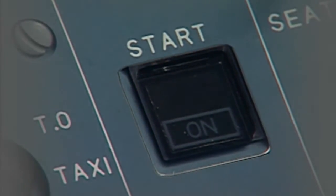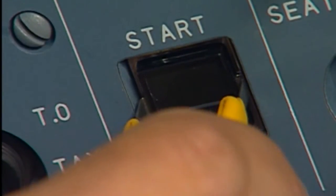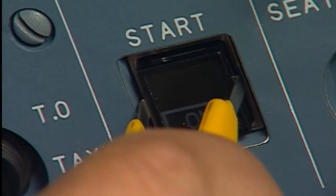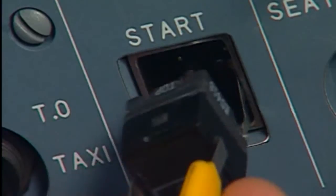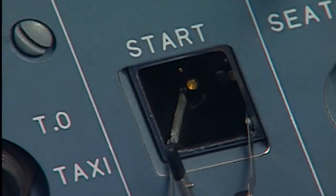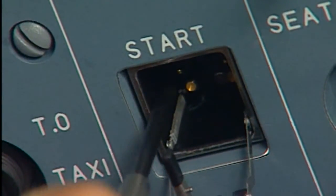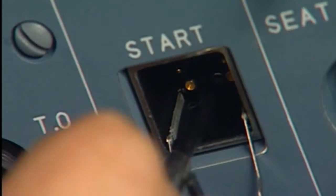Put the Removal Tool Lamp Capsule Extractor in the notches on the side of the head of the push-button switch. Carefully pull the tool to remove the head of the push-button switch. The head stays attached to the body of the push-button switch by the rods that turn.